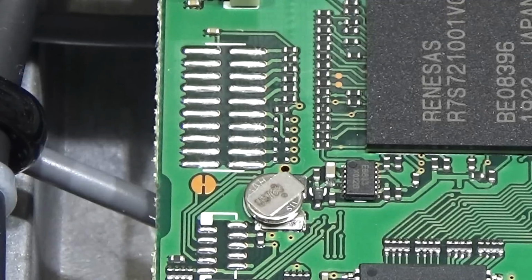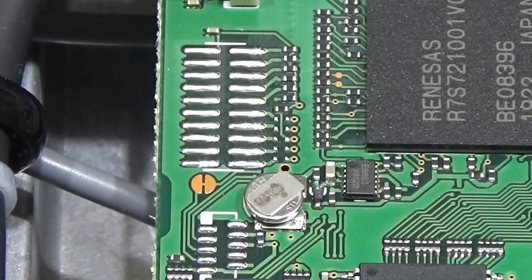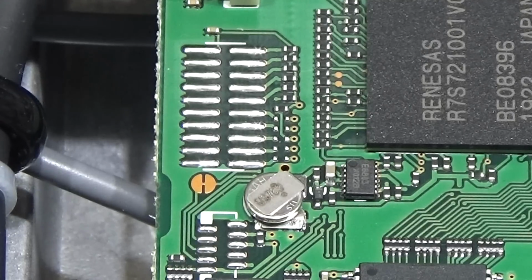And in the meantime, when the radio is completely disconnected from power, then of course the battery is needed to hold the clock data, right? And since this battery is quite little, it gets completely drained, and when it gets connected back to the power supply, it gets charged, but at a certain point these little batteries are broken and can't hold their load at all. And therefore we try to look for something different. I mean, we cannot avoid that the circuitry is drawing some current. That is necessary to hold the clock. But we can do something here with the little battery.